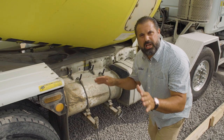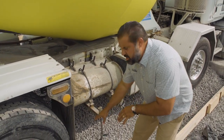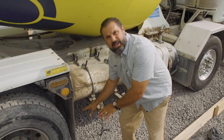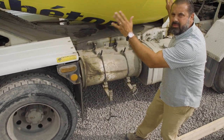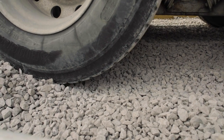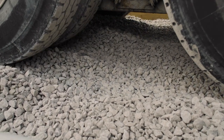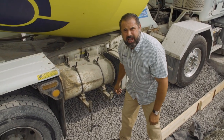One of our concerns in a porous concrete base application is the deflection of our soil subgrade and our sub-base material. We have a fully loaded ready mix truck on our base and subgrade — at this point only four inches of material — so we want to be concerned with any ruts that may appear. We're getting very little to no deflection, so we're in good shape.